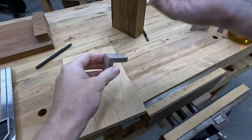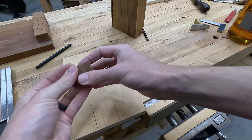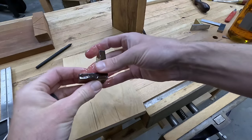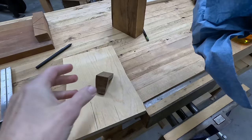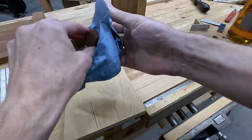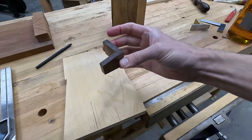The perfect finish for this is tung oil, because any sort of building finish — one that adds a layer on top of the wood — could mess up the nice angles that I just spent time trying to dial in. So I gooped it up, waited a little while, and then wiped it down with a paper towel. It's a great foolproof finish and I've used the same finish on a lot of furniture work too.